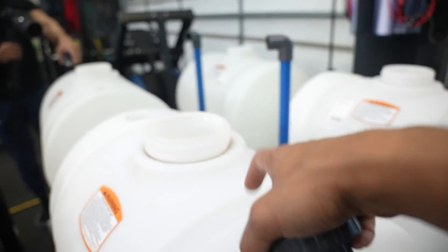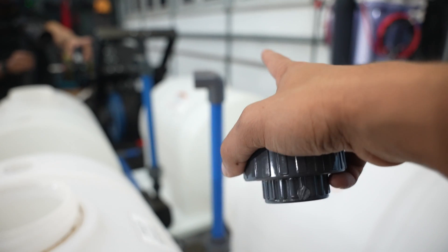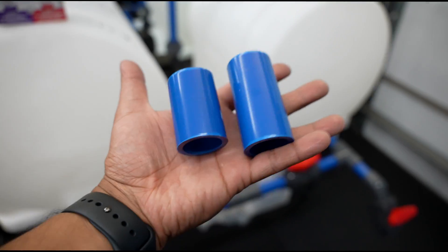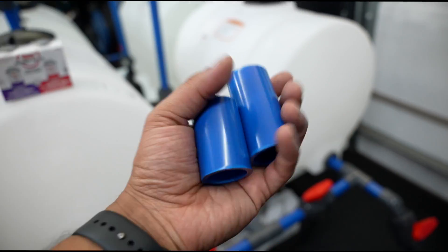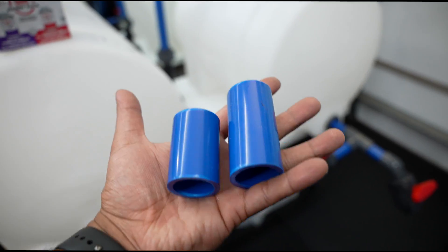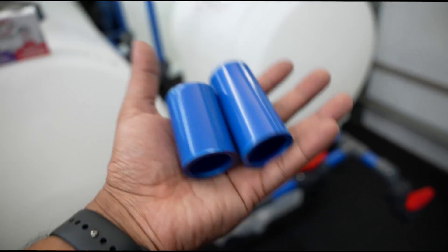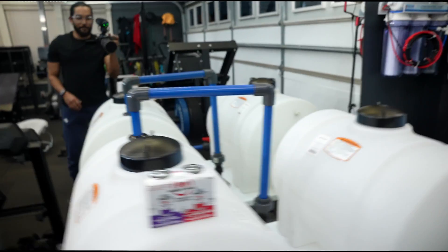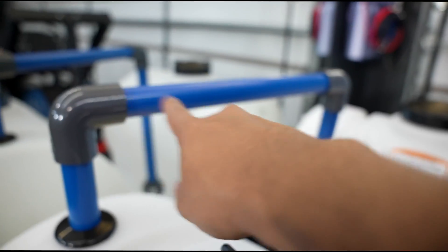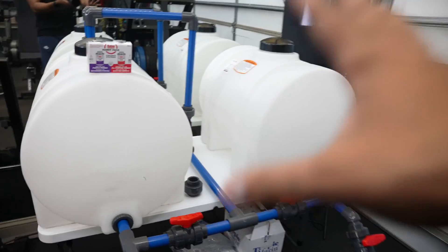Currently we're routing from the pump into the saltwater mixing tank. I went up 15 inches, put a 45-degree elbow, and went straight down. That used up all the remaining PVC from those two pieces, so I was definitely wrong — get a third PVC stick if you make any errors. Measure it, account for the one-inch insertions, and you're good.